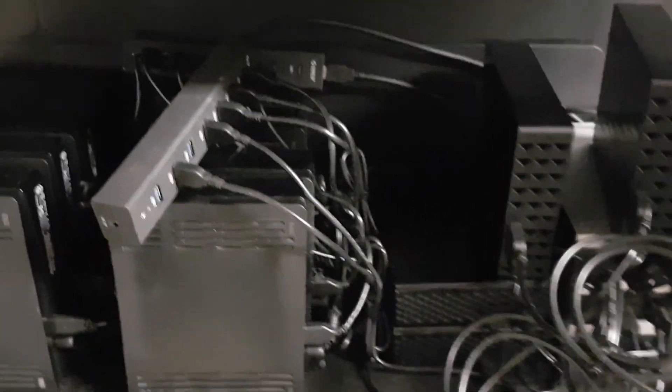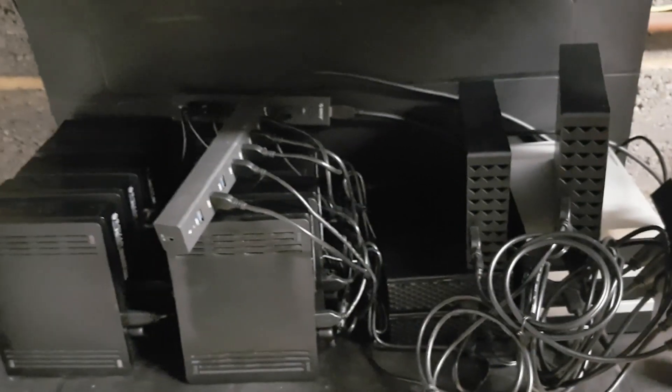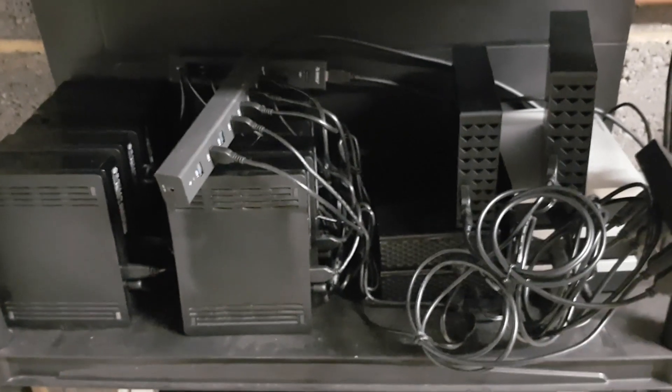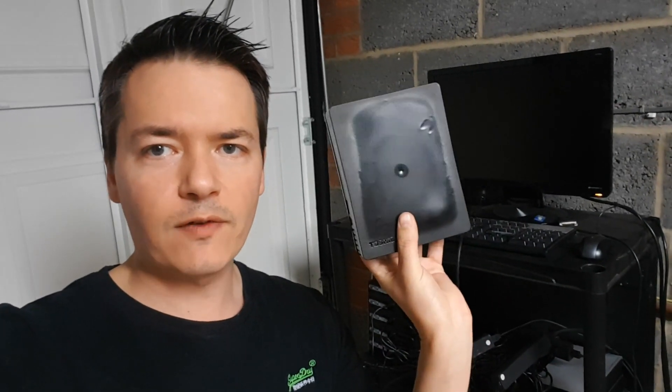This configuration — you really need to consider it properly. Set them up like dominoes, put spaces in between, and give them plenty of airflow. Do not stack them, particularly the way I had them — five high, with this one in the middle getting heat from the top and the bottom. That's the worst-case scenario. This is not a good example and I will be redoing the whole lot now because yeah, that was unexpected and it really needs to be sorted out properly.